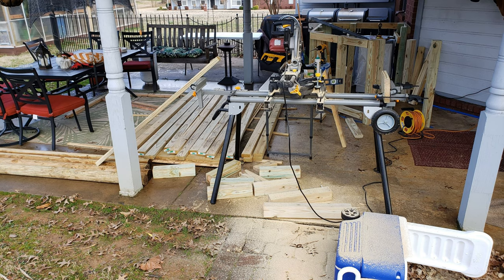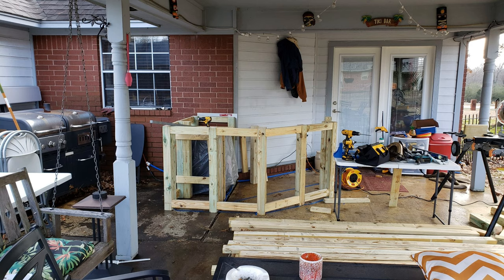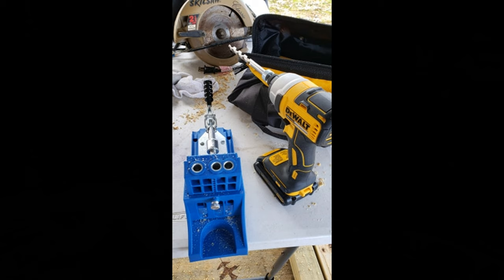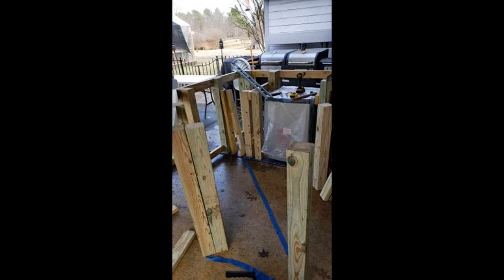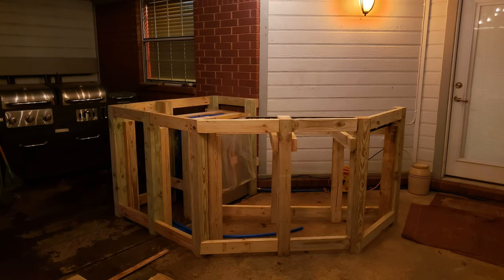Construction started. Being outside, I didn't actually attach it to the house, but I didn't want it to move, so I used 4x4s and 2x4s for a rock solid base and foundation — heavy enough that it won't move. If it blows away, we're probably going to lose the house too. A great investment was the Kreg jig; I was able to make pocket holes in the 2x4s and neatly join everything together. I started over by the brick in the back wall, cut down the 4x4s, set them out at key points, made measurements for my 2x4 cross supports, and built support and strength as I went along.